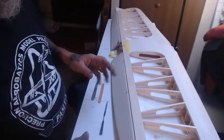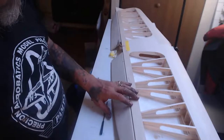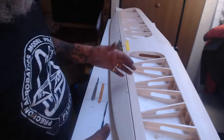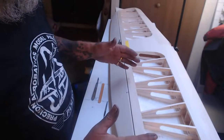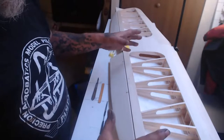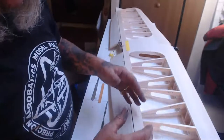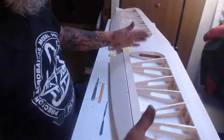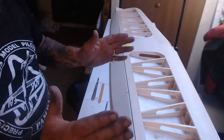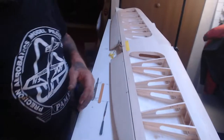Like an I-beam wing. If you look at an I-beam wing, you think, well, God, that thing will never stay together. There's just little sticks and stuff in there. Well, they hold together rather well because one part depends on the other. And the same with this Warren truss or geodesic style rib. If you angle the ribs point to point, it becomes more torsionally rigid. If they were just straight, that's how we used to do it, and they work, but these offset Warren truss ribs are stronger. If you look at a bridge, everything's at an angle. And the closer you can make the points, the stronger it's going to be.